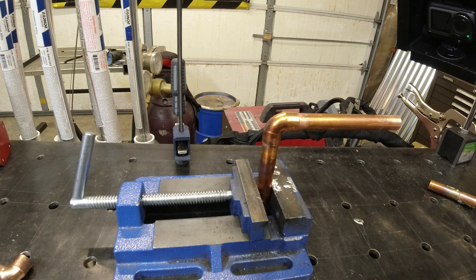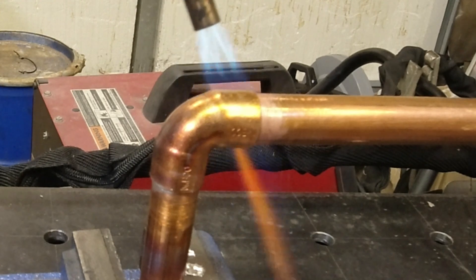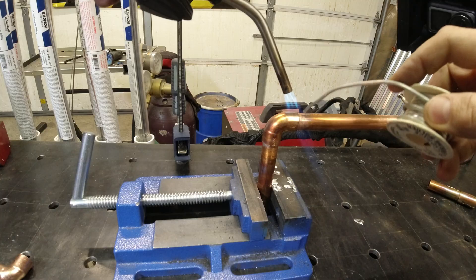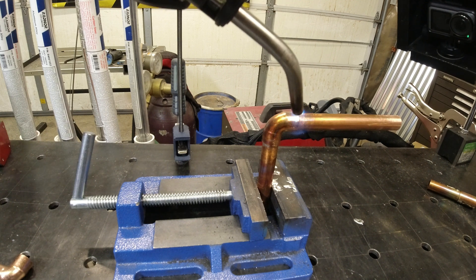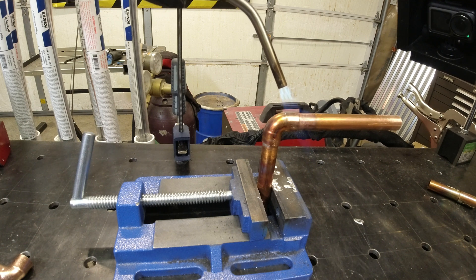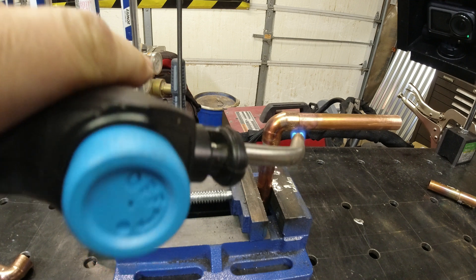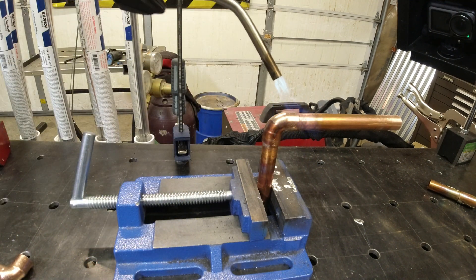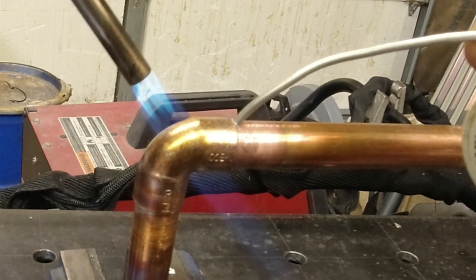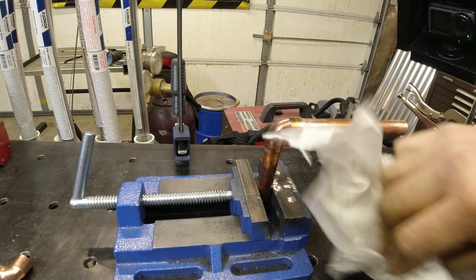Let me show you one more time. We're going to solder this joint — it's already been cleaned and fluxed. Try to heat it all the way around, just a little bit. Remember: not heavy heating, just heat the tube up enough. If you want to test, just touch your solder every now and then. You can use map gas — it heats up faster — but I'd advise possibly just using propane. Move the heat all the way around the pipe, don't sit in one spot. Heat up the fitting mainly, because that's how it's going to suck the solder in. Just wipe it off with the rag — that's it.